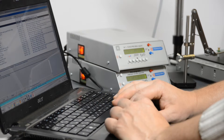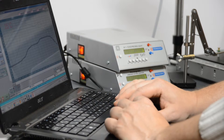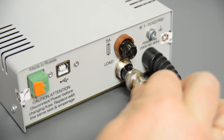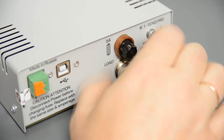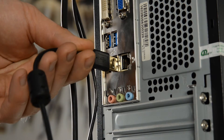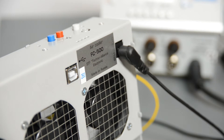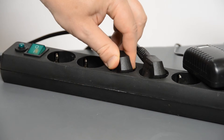If you use a laptop, please place it beside the working zone to avoid making obstacles for observation and complex part movement during the process. However, you always need to see the laptop monitor with process data. Connect both heaters' power cables to their controllers and tighten the fixing nuts at terminals to prevent undesirable disconnection. Connect interface cables from controllers and air cooler to PC USB ports. Connect the power adapter to the air cooler. Plug in controllers and air cooler power cords into power supply sockets. The system is now ready for use.